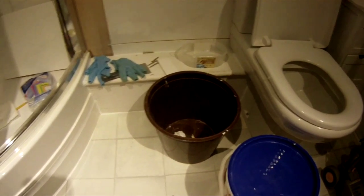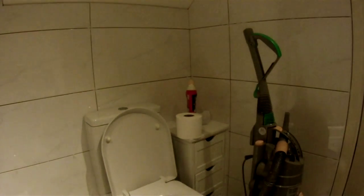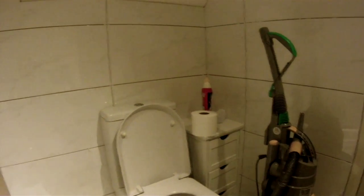In this application I've used both methods: on some parts I've put adhesive onto the wall, and on quite a lot of parts I've put adhesive onto the tile first. If you're doing a large area you can probably work quicker by putting adhesive on the wall. But where you need to take time cutting and planning, it's easier to put adhesive on the tile first — you can stop at any point without leaving adhesive drying around the edges.